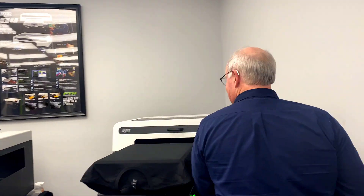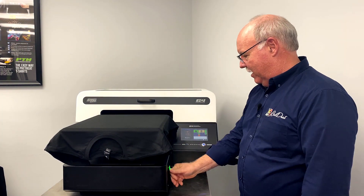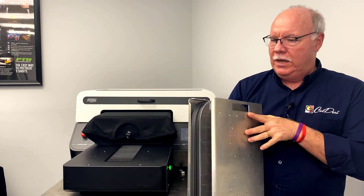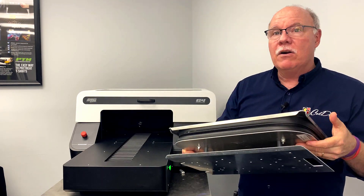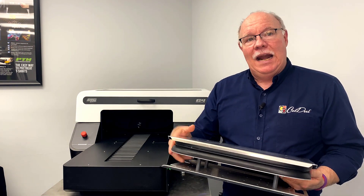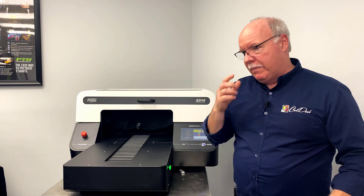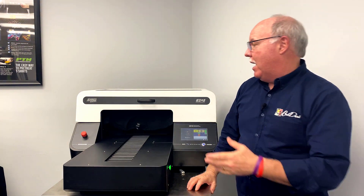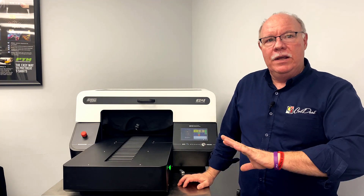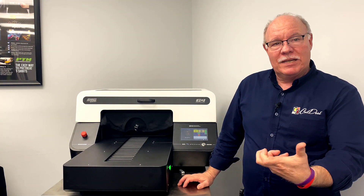Back in the early days — not even that early of days — we had this, which was a tuck lock platen, which you had to lay a shirt on and tuck all the sides into. And this isn't even ancient history; there's a lot of companies still using these. In fact, our M2 still uses these. You go back a little more ancient history and you actually had a platen like this and a frame or a hoop that went around it to hold the shirt down. It's one of the big changes in the way that printers load now, especially this vacuum platen that we have patented. It's unique to our machines. On top of holding the shirt down and making it easy to adjust, it's also helping draw ink deeper into the garment, which helps give you a better set and better washability.